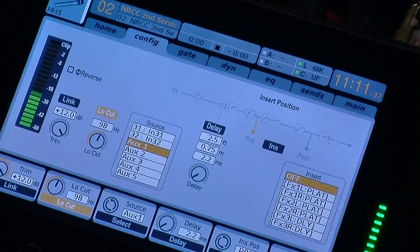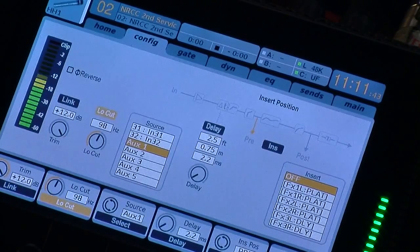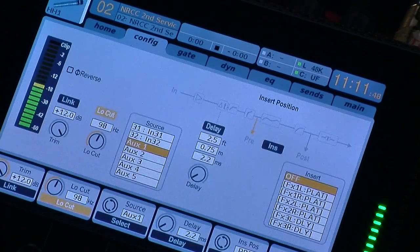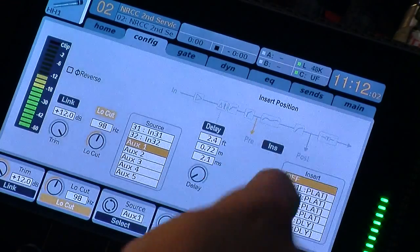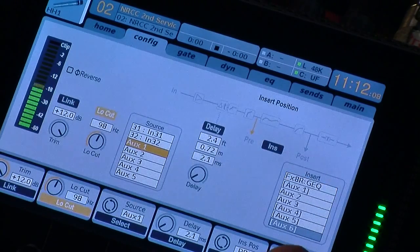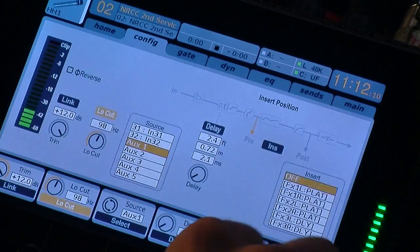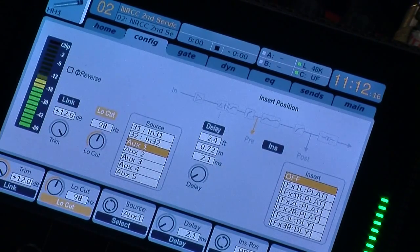Also on this page we can go ahead and Insert. You can insert maybe a 32-band equalizer, or different effects into this channel. You can select the insert point pre or post EQ, and on the right-hand side you can put the insert into any of the effects racks or into the aux sends. You can also use a hardwired aux insert — say you wanted to use a piece of outboard gear — you can do that as well.